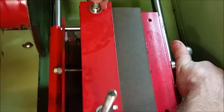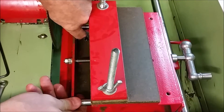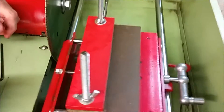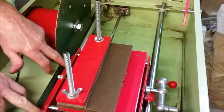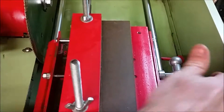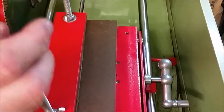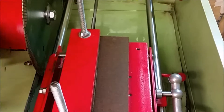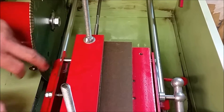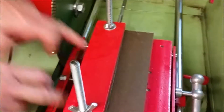When we did this design, we made it so somebody can adjust their carriage in just a couple of minutes. Now we've adjusted this. This is the main rail that actually guides the carriage. We can come back and check this one for a little looseness, but if this one's just slightly got a little slop in it, it's going to have very negligible effect. And like the others, it's also very easy to adjust. But this adjustment on this side will affect the quality of cut — that's why we made it easy to adjust.